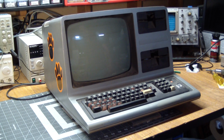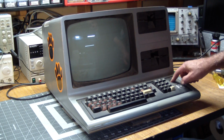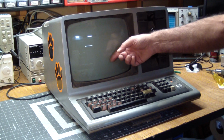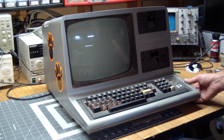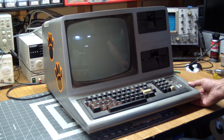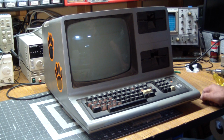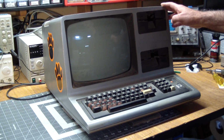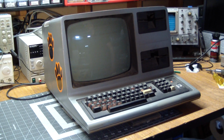Okay. That looked like it actually checked the first drive, then the second drive. That's the reset button. I didn't do anything. The screen is completely dead. No sound whatsoever and no high voltage. So we got some work to do. Let me just try the power one more time. See what it does. Oh, and this time both drives got selected briefly. And they're still running, and then they time out, and that's it. No life coming out of the screen.